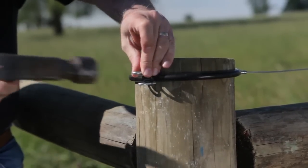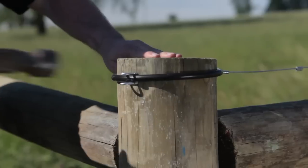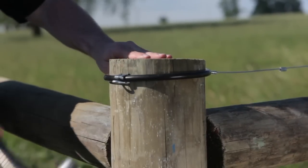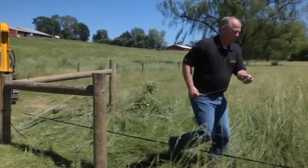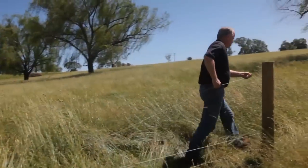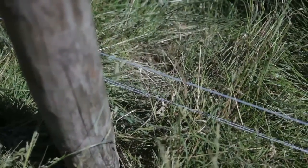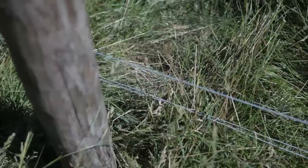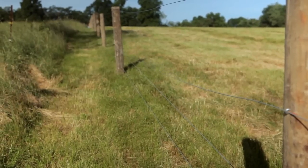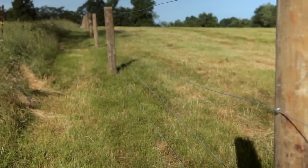For insulated electrified wire, place a staple above and below the wrap-around insulator to hold it on its predetermined mark. This keeps the staple from cutting through the insulator and shorting out the fence. All of the fence wire strands should now be strung around the perimeter of your fence and attached to the posts. Be sure you leave plenty of slack before cutting the wire — you will need as many as 12 to 18 inches of extra cable to install strainers. Once your wire is attached at both ends, your wire should be hanging loose. It's far better to have too much wire than not enough.